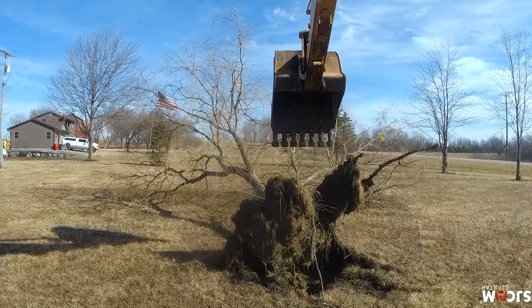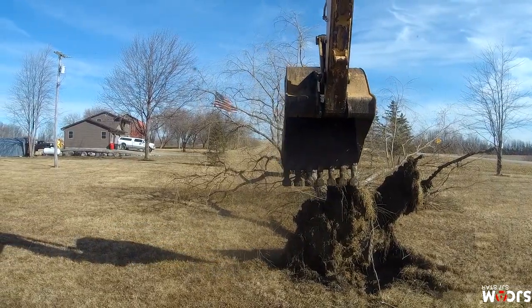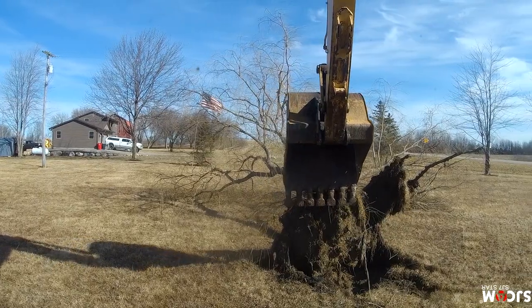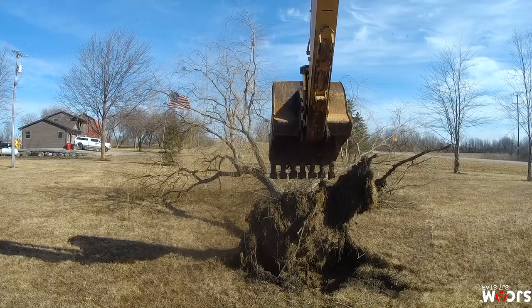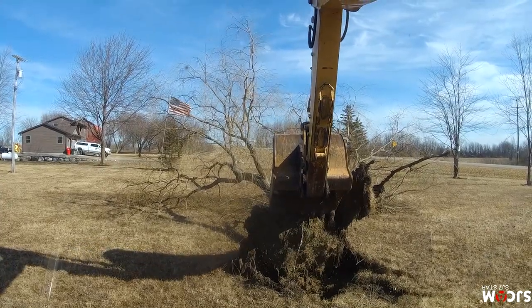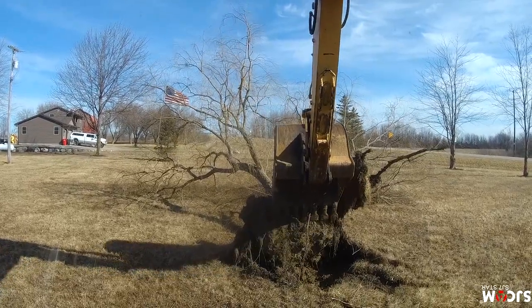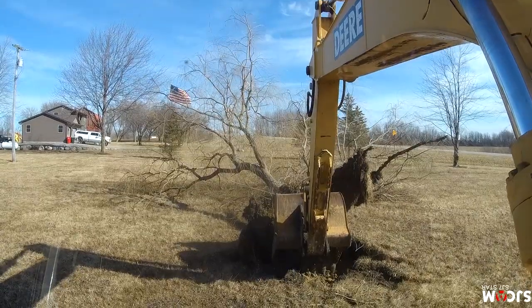So I called around and talked to a few people. They said, make sure the line for the pump or the travel motor isn't restricted, because if it is, it will do that. So I took an air compressor and blew some air through the line, and I could hear it bubbling in the hydraulic tank when I did that. So I assumed everything was good with that.